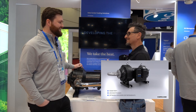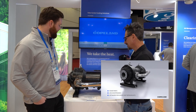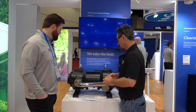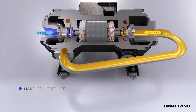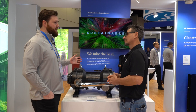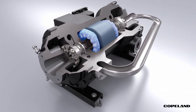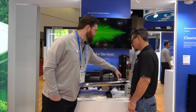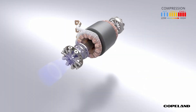This is a very unusual-looking arrangement. The refrigerant flow: you've got your suction on one end, and it has two impeller stages — one impeller here and one impeller here. It comes in the stage one side, goes through the impeller which adds a lot of kinetic energy, speeds up the refrigerant, then goes through a volute where it slows down and converts energy from kinetic to potential pressure. It gets gathered up in the volute and goes out through the interstage tube to stage two, where the same process happens again — another step of compression — before it exits out the discharge on the side.